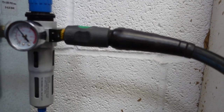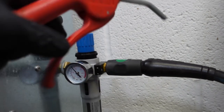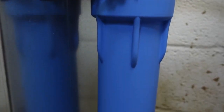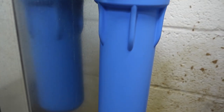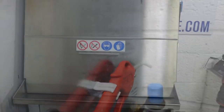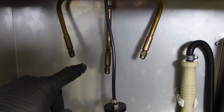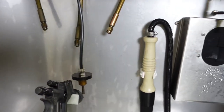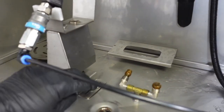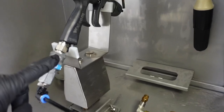There are no electrics involved in this machine — it's run by air. It comes with a water trap, all part of the system, with a regulator. You've got a blow-off gun on the side there which just clips in. You've then got a filtration system, and this will filter your cleaning fluid down to 10 microns so that the fluid coming into the machine is pretty much clean. The unit itself has these doors which start and stop the automatic wash — they're just a bi-fold. You've got three cleaning jets at the top which clean your spray gun from all different angles. And you've got the spray gun cradle itself, tied down with some wing nuts, which slides forwards and backwards so you can put a different size gun on there. You've got your airline that will come in through your gun so it works in a normal way.